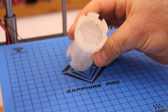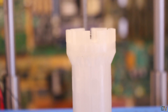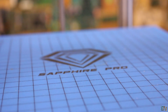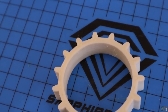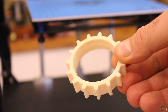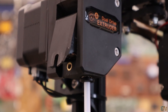Next I tested nylon by printing a tower, which turned out okay. Nylon is actually not that much more difficult to print than PLA or PETG, but the material is a lot harder and will last longer under constant use. Finally, the last test was flexible. The final result was not great but we could use the part as a tire for an RC car for example. Print at very low speed and the Bowden extruder won't give problems. The important part is that we can print flexible — even if slowly — because the dual drive extruder pushes the filament better.